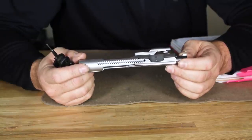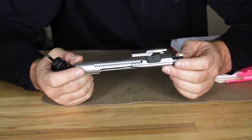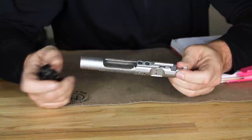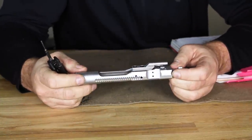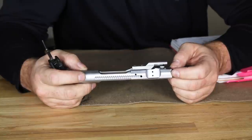Smith Enterprises is relatively hard to get a hold of just due to the fact that they don't manufacture them very often, and they pretty much only manufacture them for Brownells. However, this is very similar in quality. But again, chrome carrier bolt. Now, if you notice on the top, you will see it's not staked. Well, Smith Enterprises and Young Manufacturing are two companies that basically will tell you that it's not necessary. And the reality is that's true.